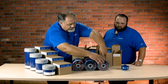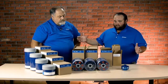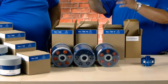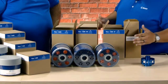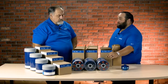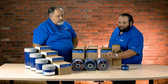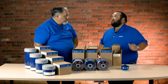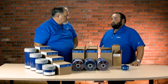The line of Titan Power Breathers is incredibly flexible — they've got different mounting configurations and different sizes of desiccant capacity. They also have a coalescing center tube, which helps mitigate oil misting from saturating the desiccant. Something I really like is the particulate retention phase on the top side: it's a dual zone micro glass media with a one micron absolute rating.